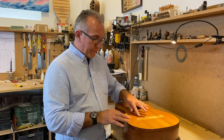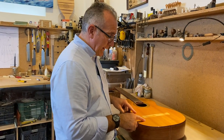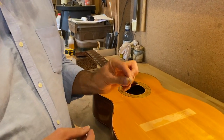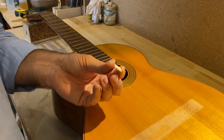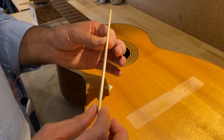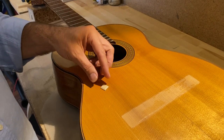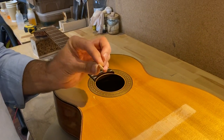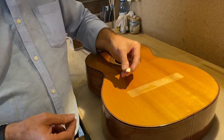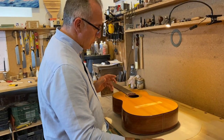You want to make sure that once the glue is in there, you can bring the two surfaces on either side of the crack level to each other. Once the glue is in there, we need to have a cleat inside. A cleat is a little piece of wood made of spruce — the same material as the soundboard. It's about 2.5 millimeters thick, 12 millimeters wide, and cut square at 12 by 12 millimeters. You also want the grain to run across.